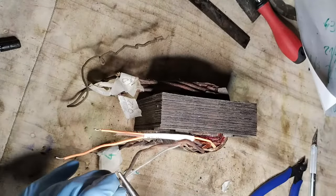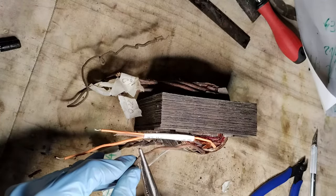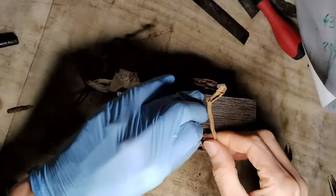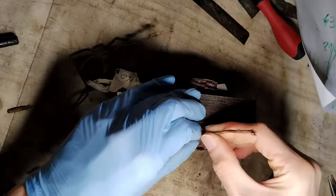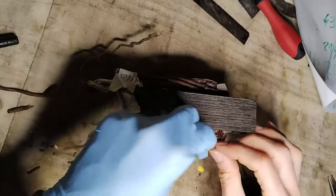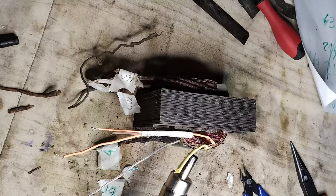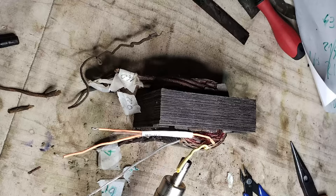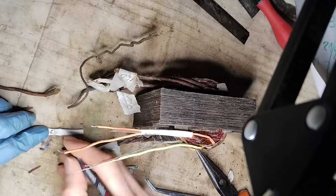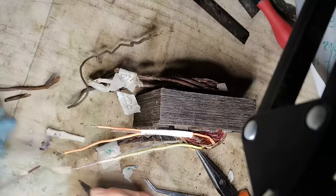The original wire insulation has become too hard, harder than the wires that it contains, which makes the wires vulnerable. Therefore, it is replaced using some heat shrink pipe, choosing appropriate different colors. The wires are also labeled, joining them in their different output groups.